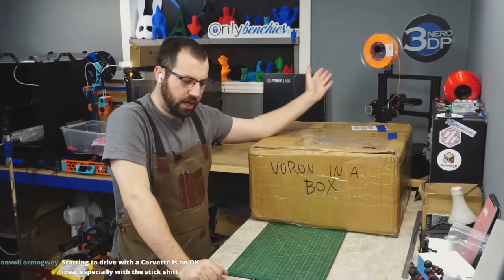There's our SSR. So our SSR is a gold solid state relay, 25 amp. Now obviously this ain't an Omron or a Crydom, but I've always held to this belief when it comes to the offshore manufactured SSRs. They do work, okay? The problem is they usually overrate them. So if it's rated for 25 amps, don't be putting 25 amps through it. But if you only need 5 amps of actual protection and you're using a 40 amp rated SSR off AliExpress, you'll probably be okay.